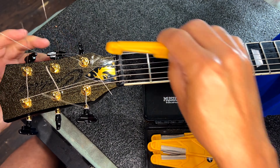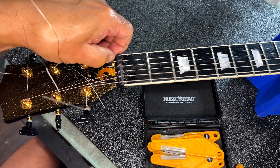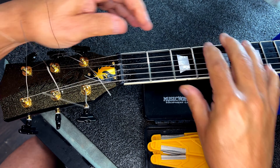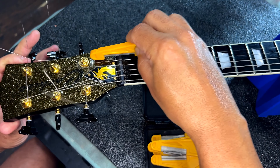I make sure that all of my files are falling off, so the leading edge next to the fretboard is the only thing that touches the string. And everything else falls off at the same angle — 15 degrees — as the headstock.